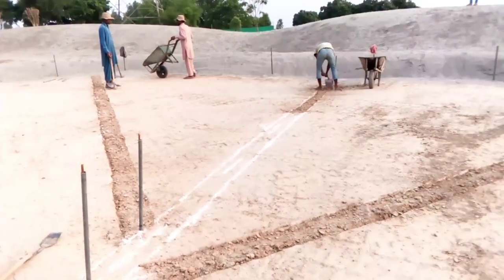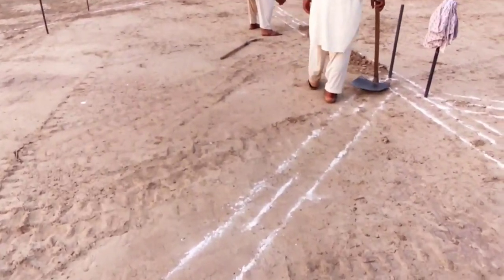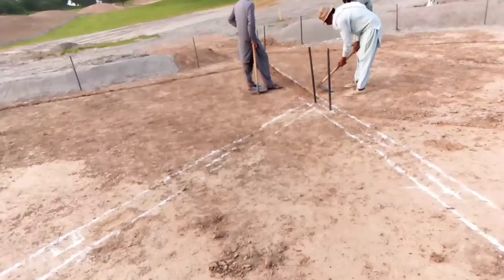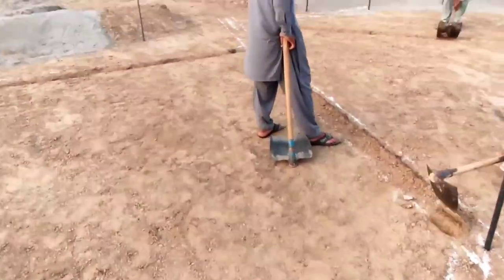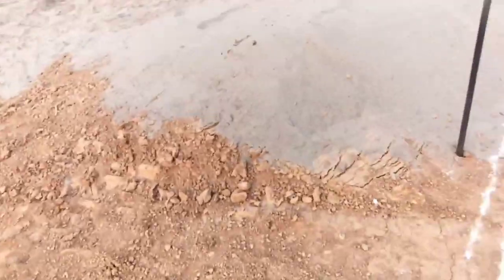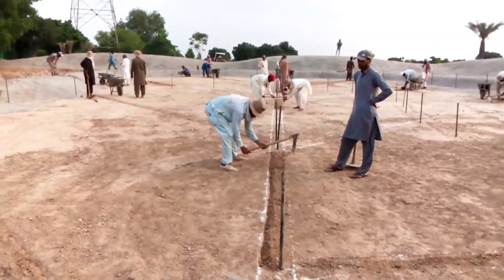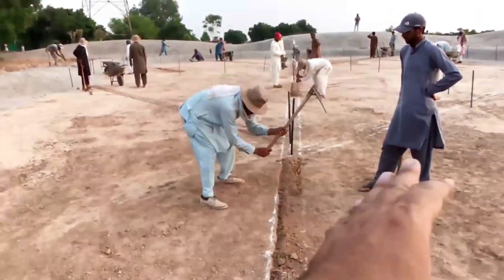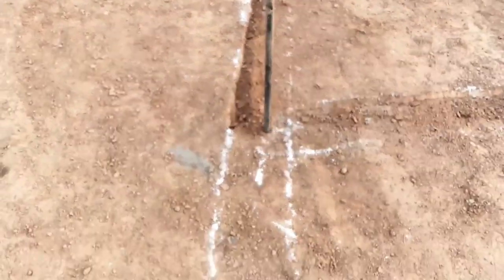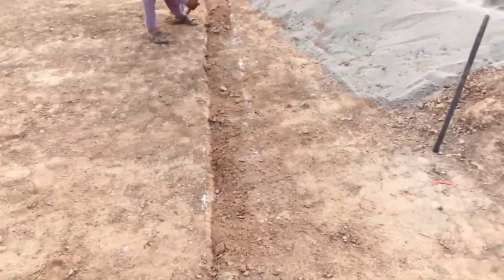You have to be careful with the slopes and pick up all the low areas. All the gradient here is falling down this way. We marked the lines and have to dig manually with shovels and pickaxe. The majority of the area is covered with YT fittings going left and right at a 60-degree or 30-degree angle. There I have two T's - one at 90 degrees going one way and one at 90 degrees going the other way.